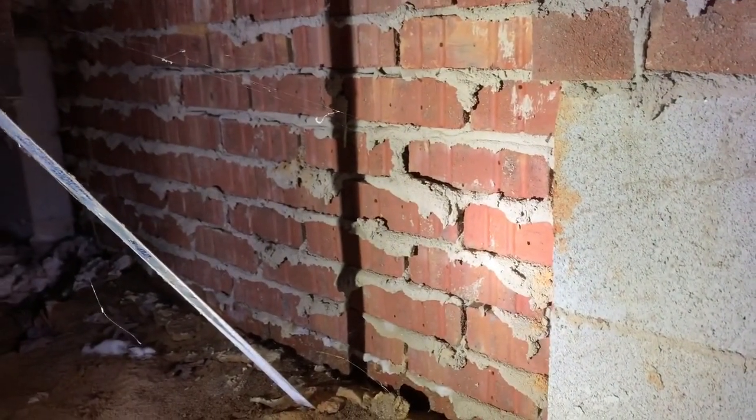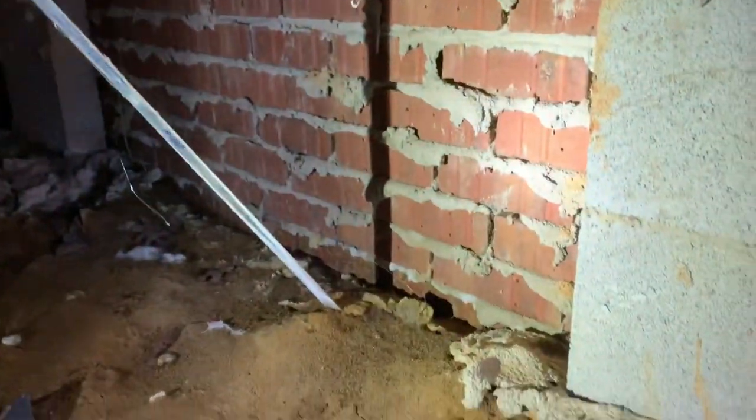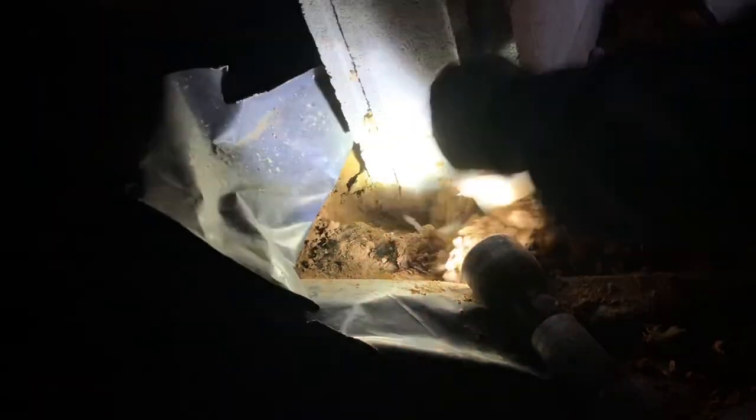In this case, we're going to have to drill this pier, this pier, and there's another pier back here beside me. We're going to have to drill this section out and then trench it, and then trench the rest of the whole place. That's basically what we've got to do in this section of the crawl space to take care of the area where the termite evidence was found. You've got to come around all the piers and dig a trench.